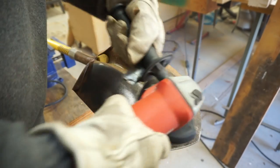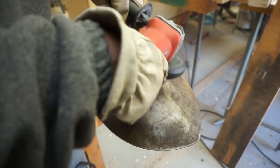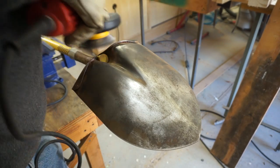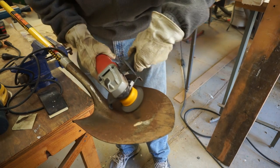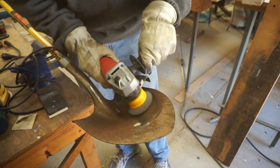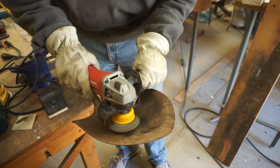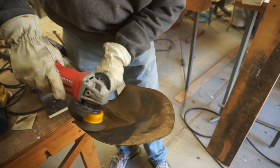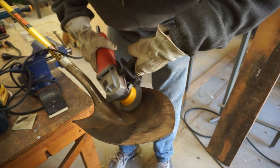This is a twisted wire cup brush. You can also get cup brushes with individual strands — those tend to be a bit softer and maybe more appropriate, but they fall apart a lot faster. I wanted the more rugged version of these wire brushes even if they are a bit more aggressive.